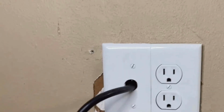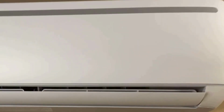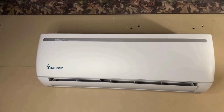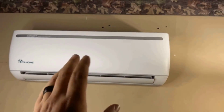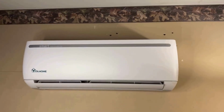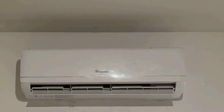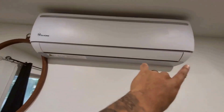From my experience, the success of this model comes from doing the install right. If you're not equipped with a vacuum pump, manifold gauges, and a torque wrench, and if tightening flare fittings to spec sounds stressful, I'd recommend this for homeowners who have a trusted HVAC tech willing to install customer-supplied equipment. You'll still save compared to many full retail options and get the performance this hardware can deliver. If you are a careful DIYer with the tools and patience, this unit can absolutely shine. Either way, don't skip the vacuum step and don't guess on torque.